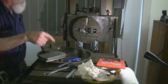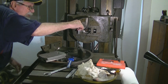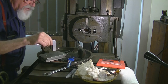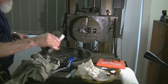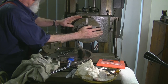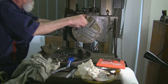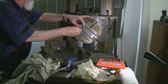You can't have the hole too deep or it'll pull up against the nut — so it's a very fine balancing act. If I put the base of my little square across, it's not proud on the surface — it looks like it fits very, very well. So I think I'll just have to take a very small amount out of there — probably only two or three thou. Putting it back up like that... I might have fixed it.